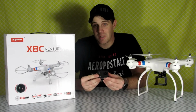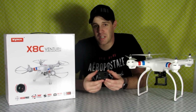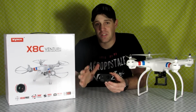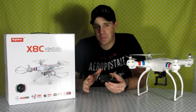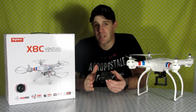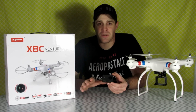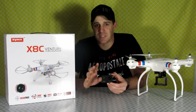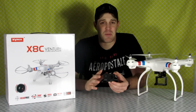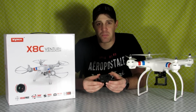Alright, so that was 1080p, 60 frames per second. This will shoot all the way up to 4K, 30 frames per second, but on this mount, on this quad, with all the movement going on, those frames can't really keep up. 1080p, 60 frames per second is actually great for when you're flying. It helps reduce a lot of your jello, and it also gives everything a lot smoother look. Now, the fuzziness in this image is partially due to the editor I used. I wasn't really happy with the results there, but it's a good example.